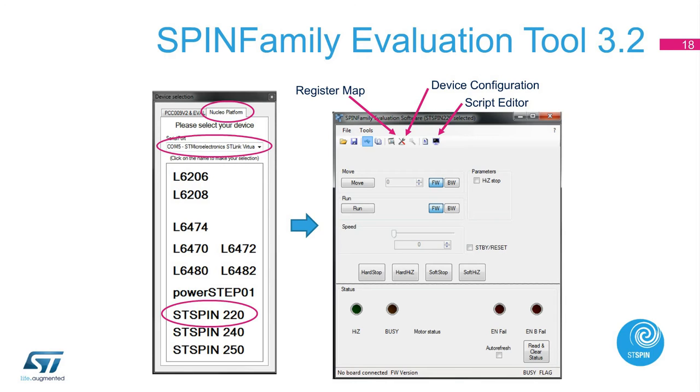The main control window allows you to control the stepper motor movement. Either you can use the Move command to move the motor a specified number of microsteps, or the Run command to let the motor spin at a changeable speed. There are four options to stop the motor: Hard Stop will immediately stop the motor, holding current standing in the register. Hard High Z will immediately stop the motor and the switches of the bridges go into high impedance state — essentially open, with no current flow through the MOSFET. Soft Stop will stop the motor after deceleration, with the deceleration rate stored in the register. Soft High Z will stop the motor after deceleration, similarly putting the bridge switches into high impedance state.